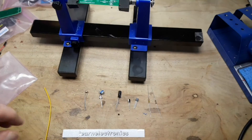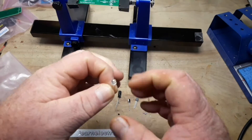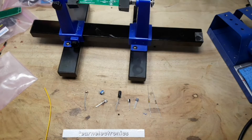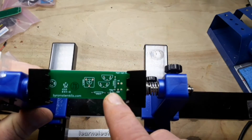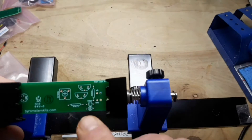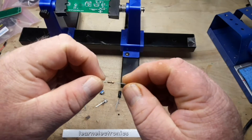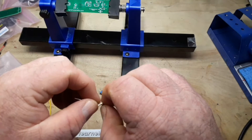I've got all the parts laid out here. You can see he's included one of these little straw hat LEDs which has a nice wide dispersion. We have everything laid out real nice here — a 100 ohm resistor and a 47K. If you know your resistor codes, brown, black, brown is 100. So we'll start by putting that one in.